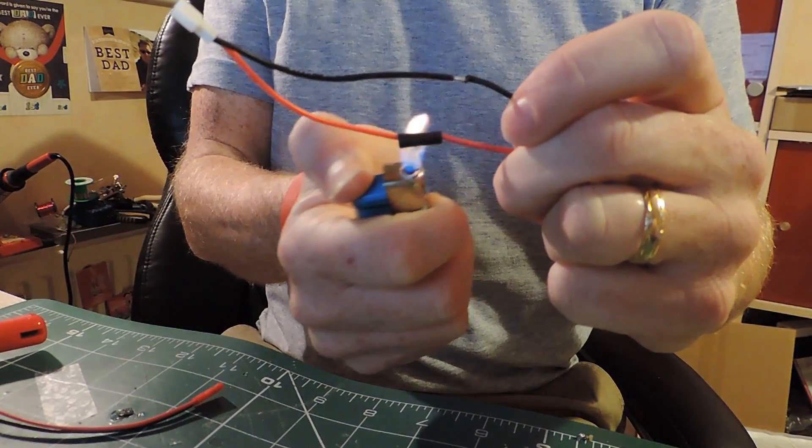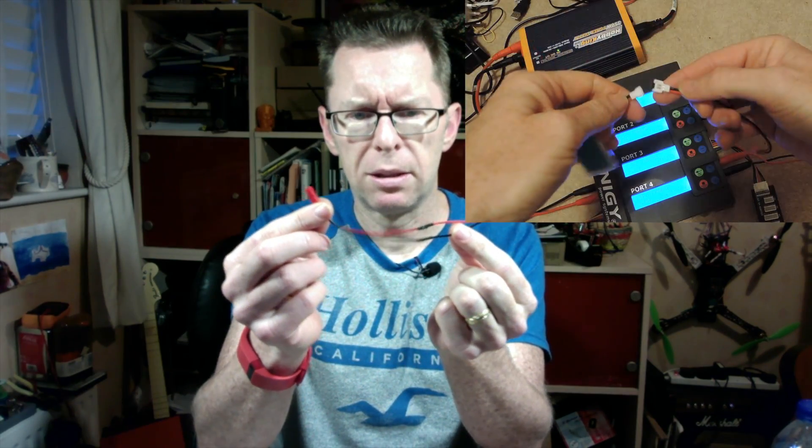So how to fix it - my quick tip, maybe four things. First off, take a pair of snips and snip it. With these two cables you then wire strip it, solder it, heat shrink it. You're probably asking what should I solder it to - for me I've got a bunch of these little JST pre-made connectors which I can plug into my charger, which is quite handy. The end result is a couple of these little things which will plug into my charger so I can charge a couple of batteries from it.